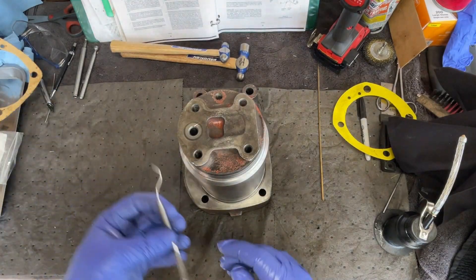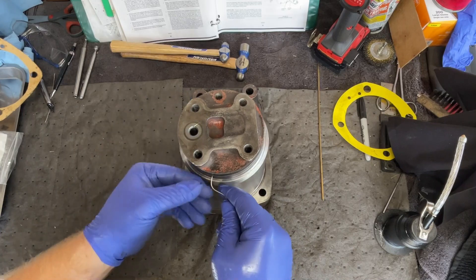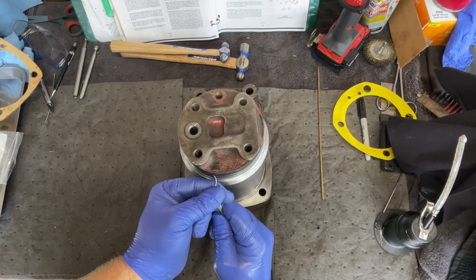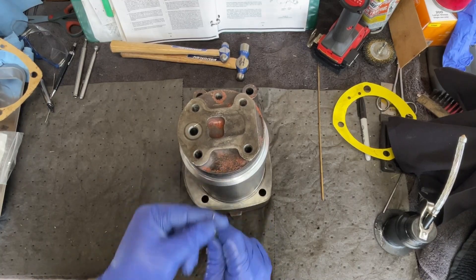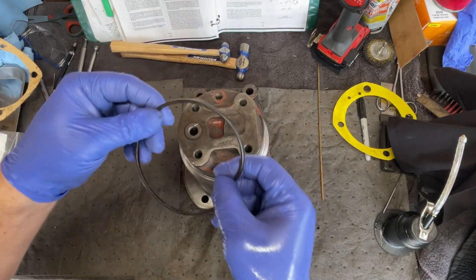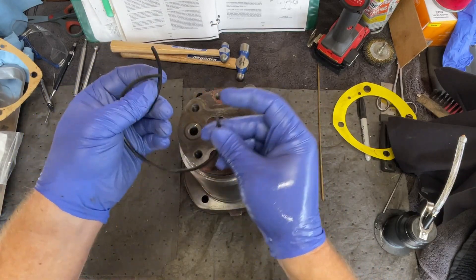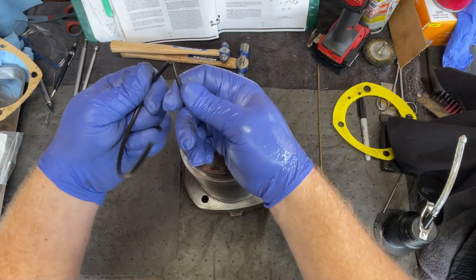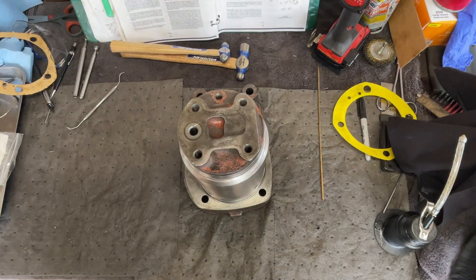I think the next step will be to replace the O-ring on the outside of the hydraulic cylinder. The whole reason I took this thing out was to just clean it up and refresh that O-ring. This was not leaking, but it is bad though — look at that, I was able to break it. Look how hard that O-ring is — this O-ring was bad. Snap. Glad I replaced it. Every one of these O-rings in this tractor that haven't been replaced are over 50 years old.